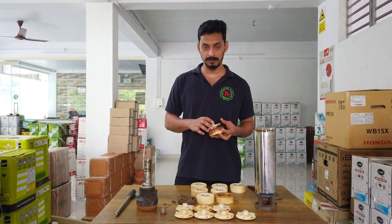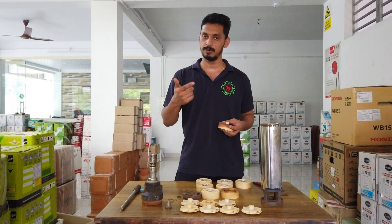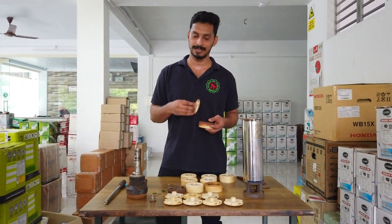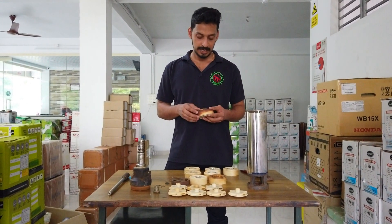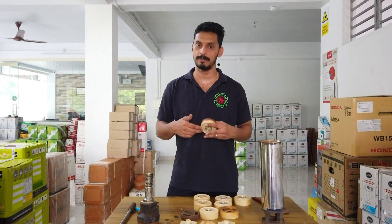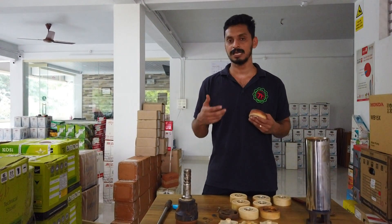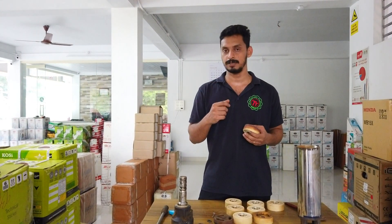What is the axial flow? In the axial flow, there is a propeller action — there is a propeller in front. The axial flow pump will add to the delivery side, so the head will be added. The third category is the mixed flow, where radial flow and axial flow are combined in the design to add to the discharge pressure. Here, the fluid flow moves and passes through both the radial and axial flow paths.